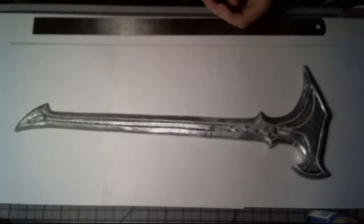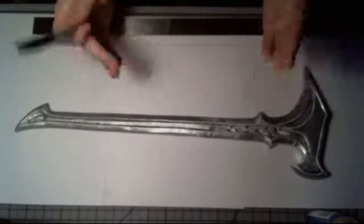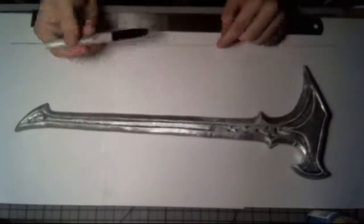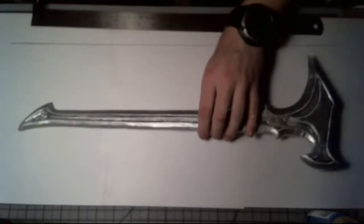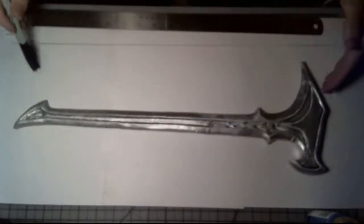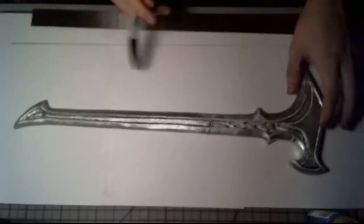I'm making basically a katana stand. So it's got three pieces. It's got the base and it's got the two vertical stands. I'm drawing the pattern for the base right now, and it's going to be 21 inches wide, so 2 inches longer than this. And then it's going to be kind of a trapezoid, and then the top of the trapezoid is going to be 19 inches long.